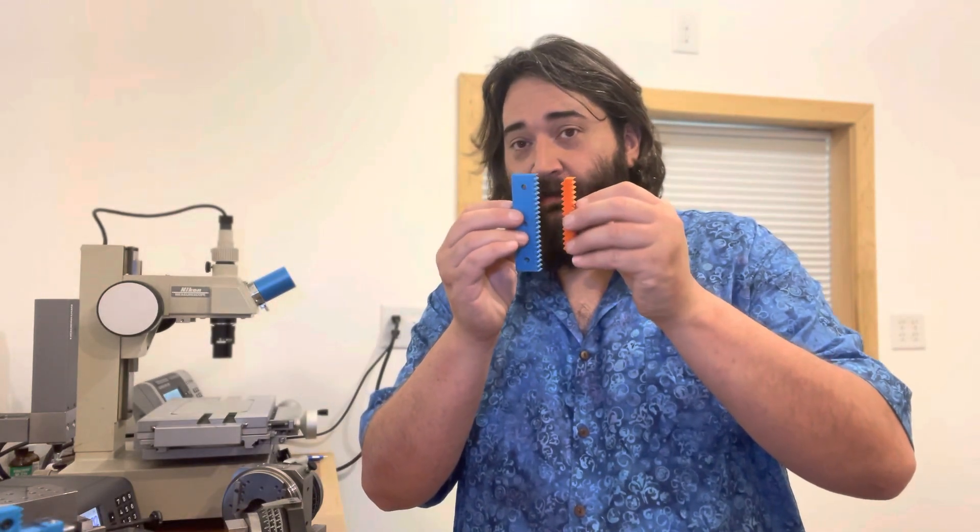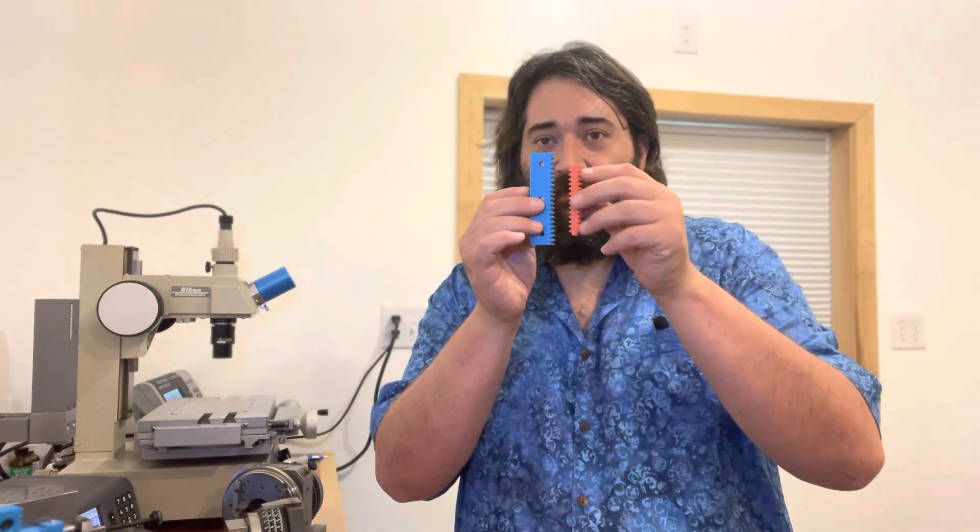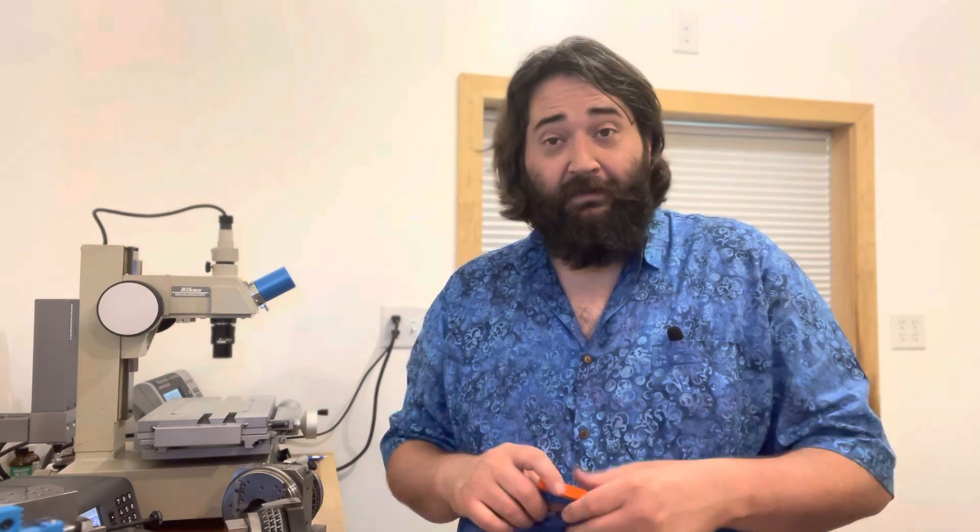You might have to scale and mess around with it some. One tip: print everything in one setup, spaced, going in the same direction. If your Y and X accuracies are not the same, it's going to give you some weird pitch difference between the two, whereas if you print in the same setup going in the same direction, they should have relatively the same pitch errors. If you take advantage of this, I'd love to see it. If you noticed the sound quality was better today, we have Dylan Jackson of Proteum Machine to thank for that — Dylan's a big member of the online machinist community, he hosts the With Intolerance podcast, and is all around a good guy. Thanks for the new microphone, and thanks for watching — hope you enjoyed.